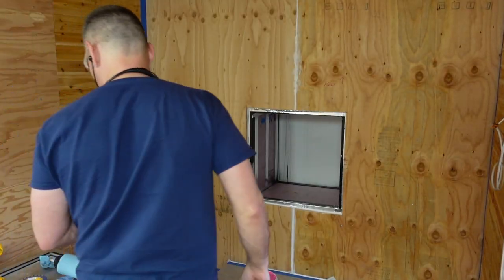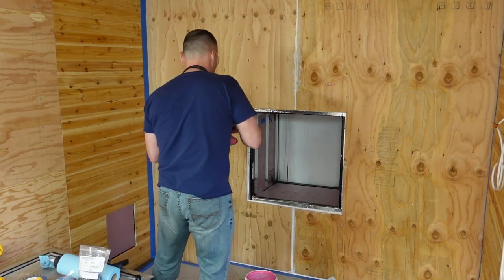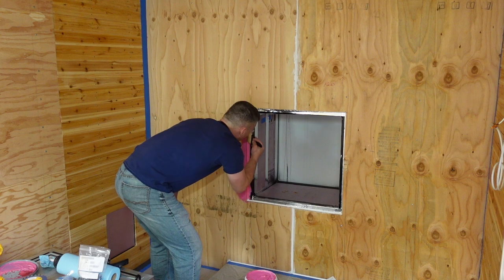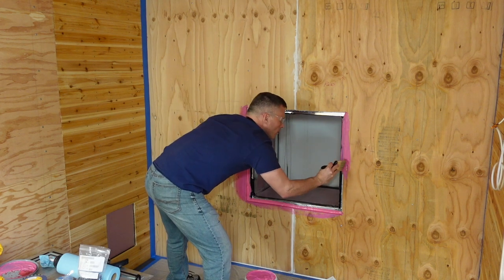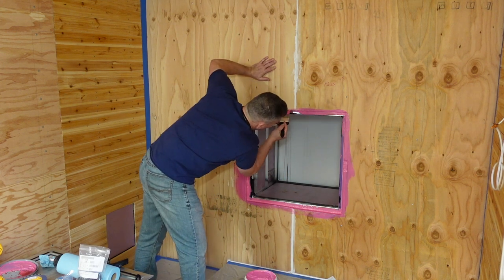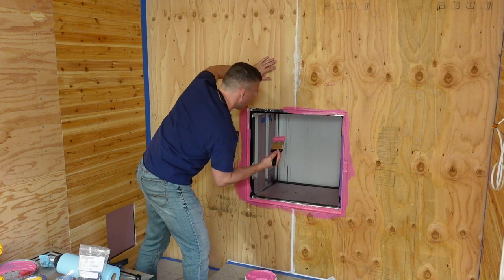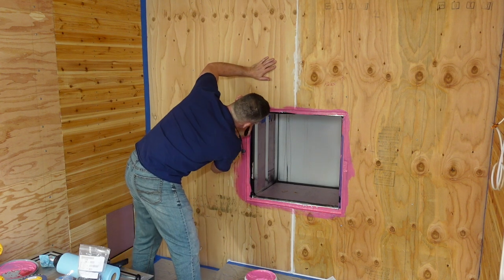Always looks good — hot pink. Going to goop a little of this all over our edges, nice and thick but not too thick. Going to come back and do probably three more coats. Goes on pink, dries red. Turns into a pretty nice water barrier. This is for when water gets behind the tile — we want to have another water barrier back there.